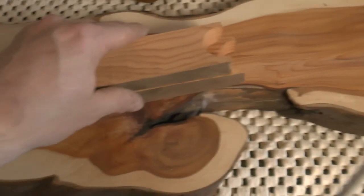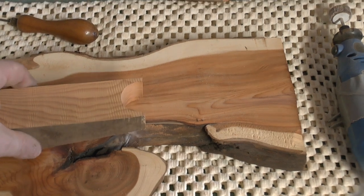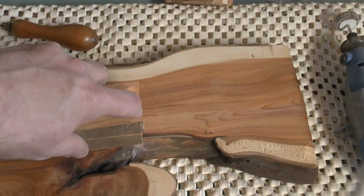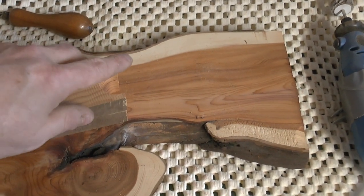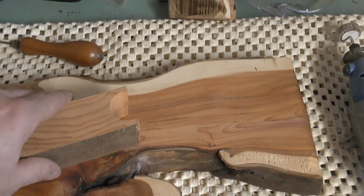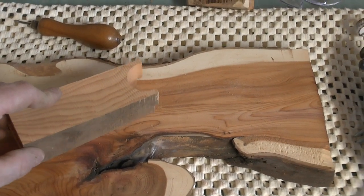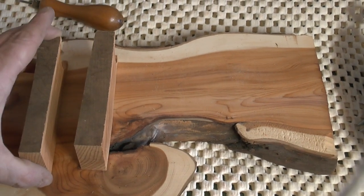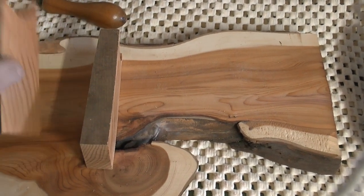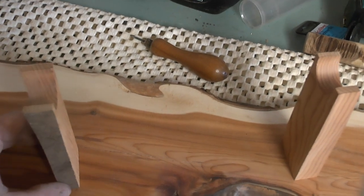Those first two blocks that I cut and milled were too small, so what I did was chose a bigger piece, drilled through with a one-inch forstner bit and then sliced the circle in half because I don't need a circle — I just need a dished-out rest. Then I milled the block down its length to give me two pieces, and these will need more fettling in a minute but they're going to sit on here.